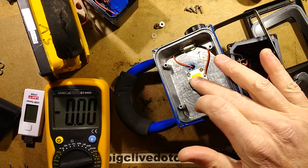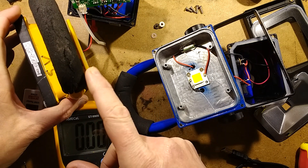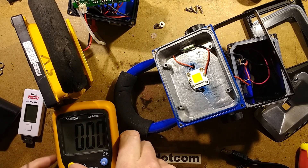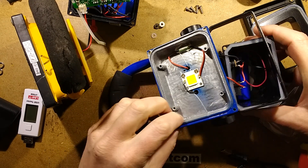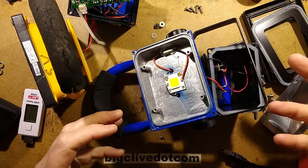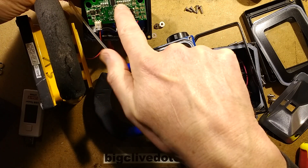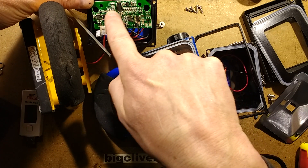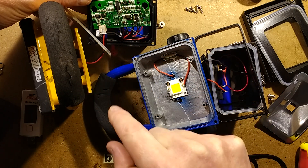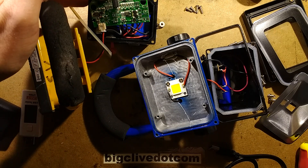I think the COB chip is just for show, to make it look like a high-power LED. This industrial one is very good quality — I'm guessing it's quite expensive. This cheapo one shows — it's kind of empty, but it still works and is a case you can use for other things. I'm still intrigued as to what that mystery chip is for; it's not immediately obvious and there's a really huge amount of circuitry on the industrial board. I think I'll put this on test, let it run down, and see if it gives any warnings when it's about to go off.